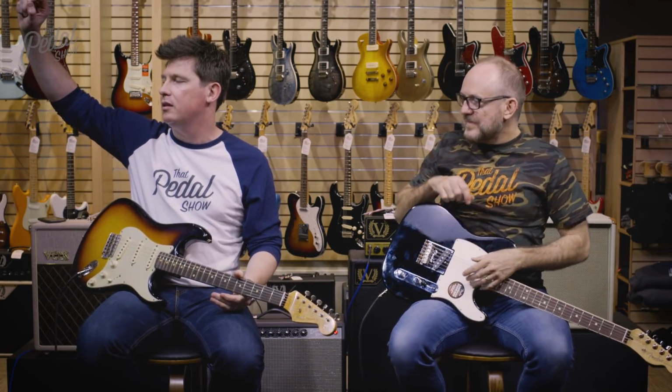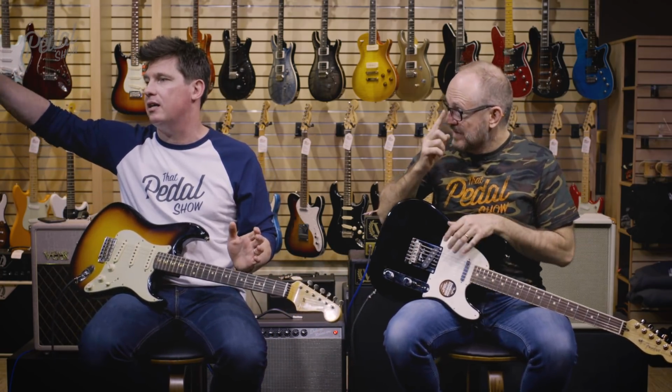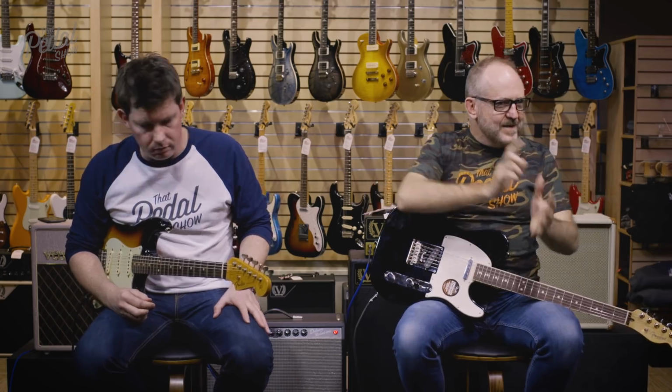I don't know if you could hear that, but you just get that sibilancy high end back. Yeah. So we're gain stacking. We're still gain stacking. We're adding a boost after a fuzz. So the point about this is, it's not just the buffers at the input of the fuzz you need to be aware of. It's also buffers after, especially with germanium fuzzes.